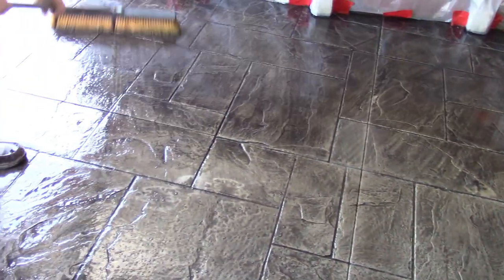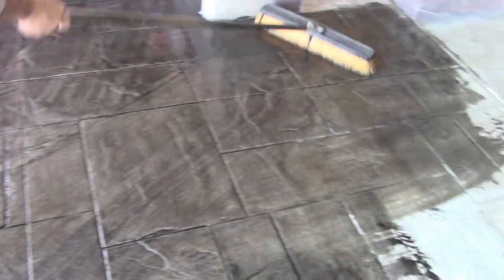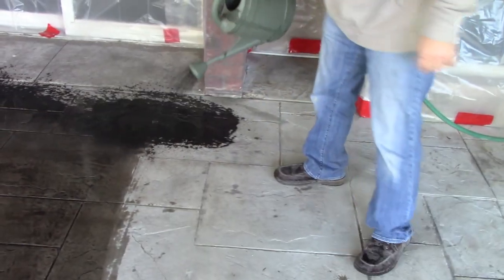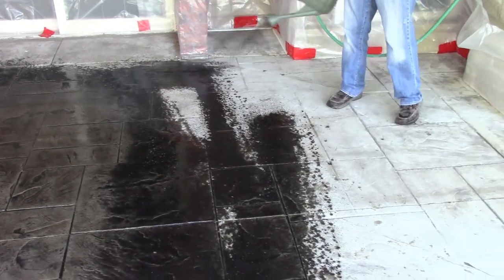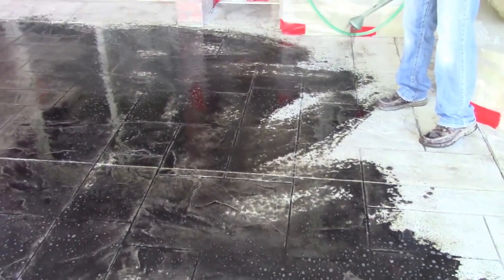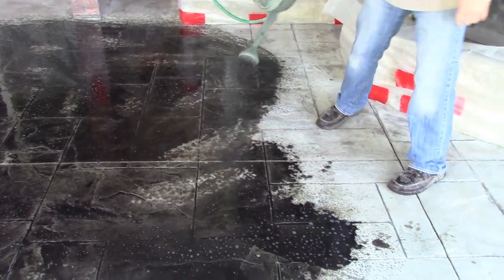As you can see, it just drops right into the holes. When you think you're getting close to finishing an area, just simply get rid of any latent footprints and then let the material start to soak in. As it dries, the color's going to fade down, but you're going to be left with all the pigment in the low recesses. Don't worry about overlap, because we're still in the cool part of the season — we're not too worried about hot concrete. If you were doing this in summer when the concrete's very hot, it's very advisable to pre-wet the surface, so it slows down the evaporation and setting of the color.